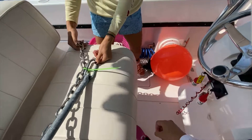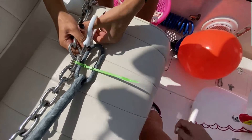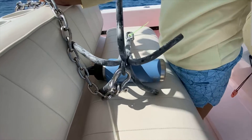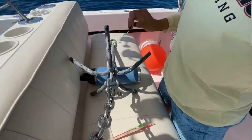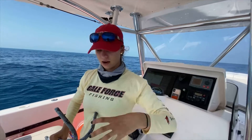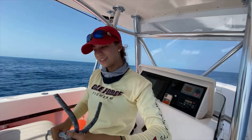What's going to happen is that tension is actually going to break the zip tie. The zip tie broke. Now what's going to happen is this chain is going to come in this direction and we're going to start pulling the anchor this way. And just like that your anchor tripped — it's up, it's out of the rock and you're pulling it out of the seafloor, not digging it deeper.